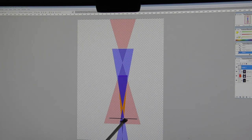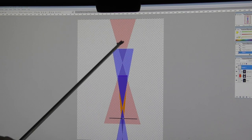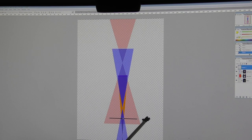If we start changing the power in the beam, the relationship of all these sections is going to change. Remember the model of the Gaussian distribution? When I reduce the power, I change the intensity of the beam and the shape of the beam. So this is an impossible situation to actually model. You just have to live with what you've got. We cannot change the way in which the lenses are designed. We've just got to get used to the fact we cannot get anywhere near the specifications claimed for these lenses. The specifications for lenses is based around an imaging system, not a damaging system, which is what we are using.